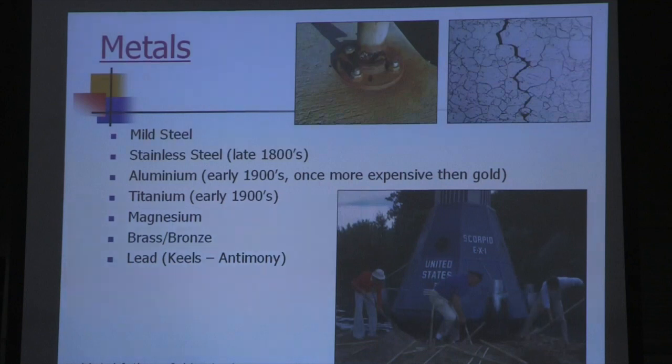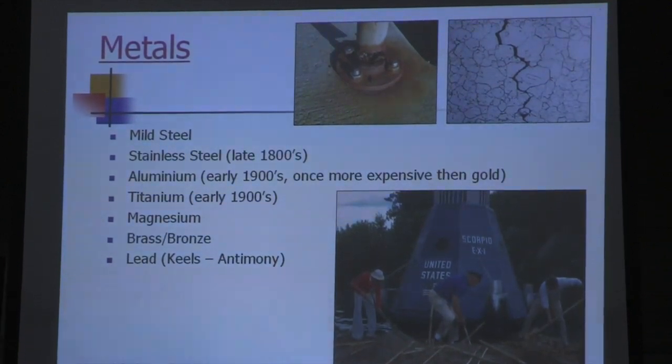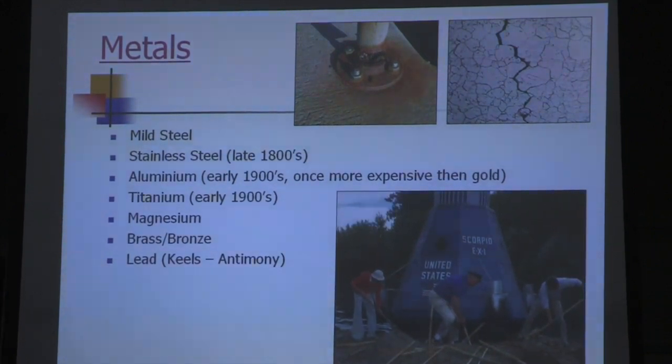Plus also, their rods. Handrails. So yeah, if you get some phosphoric acids, which is sort of Coca-Cola, but then you go up to nitric acid, which will do it really fast. Then you're up to hydrofluoric acid, which does it really fast, really nice, but it's a really nasty acid. Pool acid. Yeah, pool acid, hydrochloric acid, muriatic acid works as well. It's not quite as good as nitric.